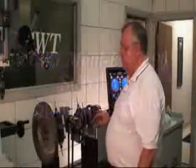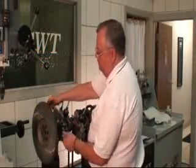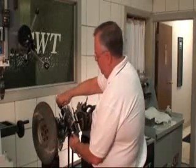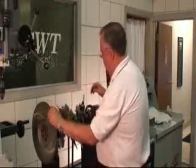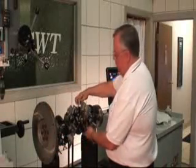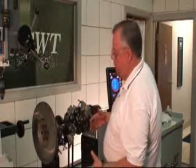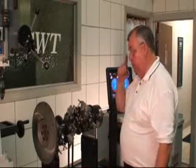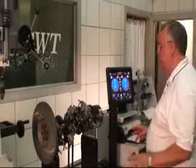After we've mounted the bob weights, we already know where their horizontal position is. We're going to go through and do a quick safety check just to ensure that everything is snug so nothing's going to fly off. Safety is a mandate of any operation, because you do have an open architecture here where the operator is going to be in zone, and unfortunately you may have someone nearby. If something should come off there, it could cause bodily harm — we have to be very careful.